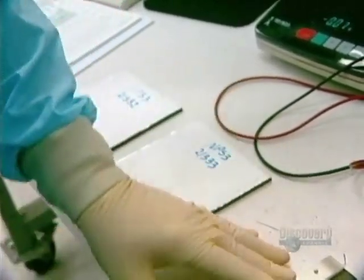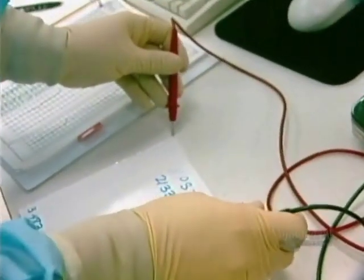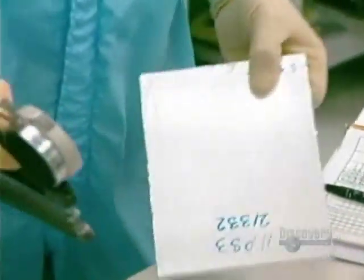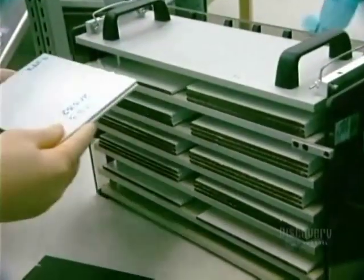Here a test is made. Using a voltmeter, the battery is checked to see that it produces the required 3.56 volts. Any problem can be detected here and corrected. A final quality check is made with a caliper, which precisely measures the thickness of the battery cell.